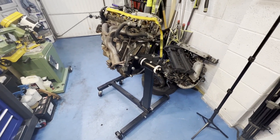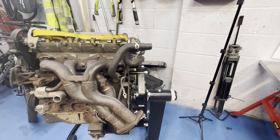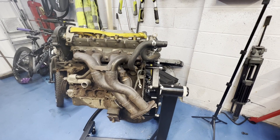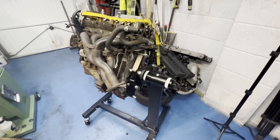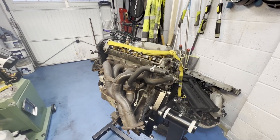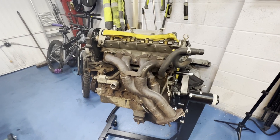So there we go — I've got the engine up on the stand now. Off camera I machined up the rest of the bolts; they turned out really nice. What I did have to do though was chop off the end of the bolts — for some reason when I was using the die on them they distorted — so I chopped off the wobbly part and they all threaded in fine. With the small improvements we made to this stand I'm happy now. Next video we'll get on with disassembly of the MX-5 engine, ready for forged rods, honing, some new rings, and other bits and bobs. Thanks for watching, like and subscribe, ring that bell.